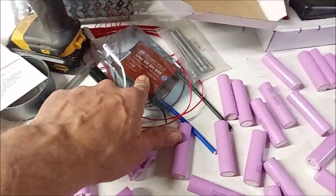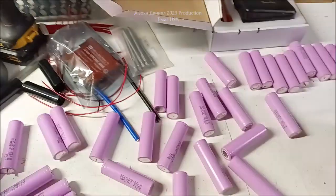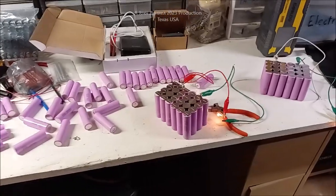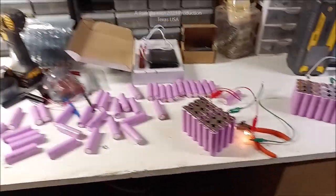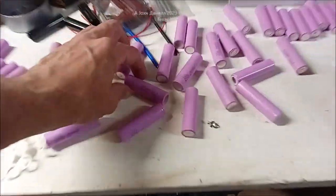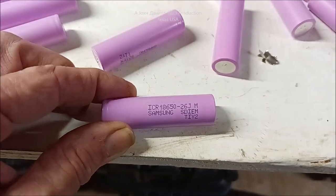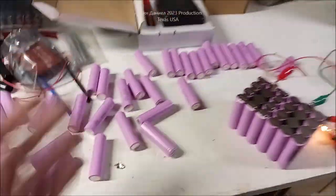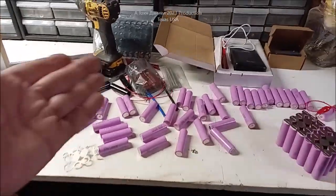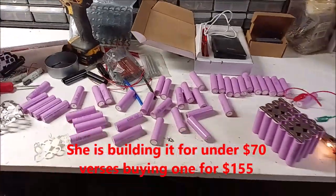She's got her BMS here, and this is for a battery pack to go on a scooter she's building herself. Because everywhere else you're just getting used cells — you buy what looks brand new and you're getting a lot of used cells, and as long as they pass going through the line you might pay $200 but it won't last you a year. These are medical grade — Samsung 26R, 2.6 amp-hours apiece — and she's going to have a 10.6 amp-hour setup, about 36 volt battery set, 42 volts fully charged.